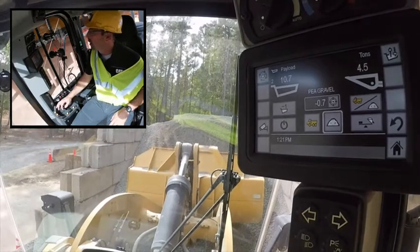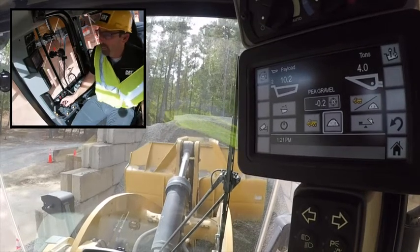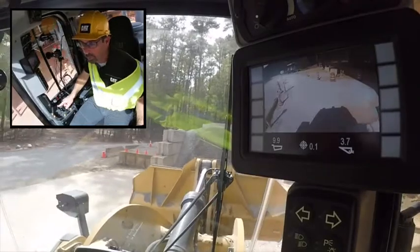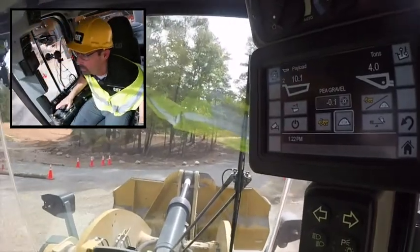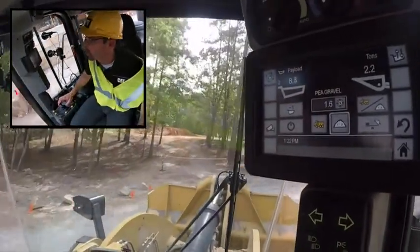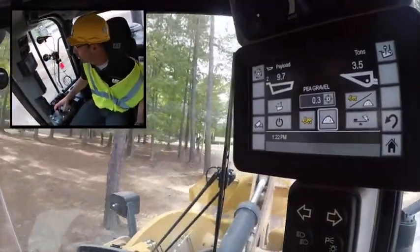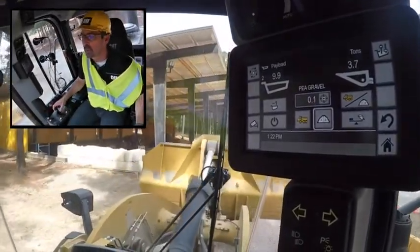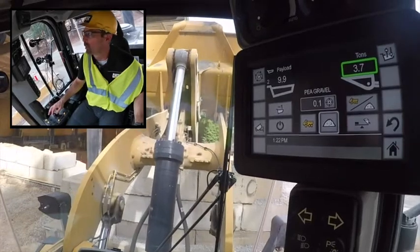I want to basically come just shy of it, because as I rack and dump that bucket out, that load measures a little differently. You do a good job of accounting using that tilt sensor on that bucket, but we don't have a pressure sensor in that tilt circuit, so you've got a little bit of adjustment there — some estimated weights you're dealing with. But as you adjust that bucket down on your final approach to your target, you're passing through that precision weight range again and getting a good world-class estimate right on that final bucket load.